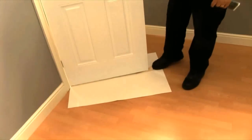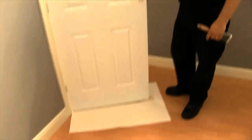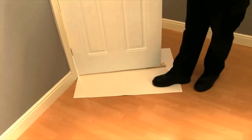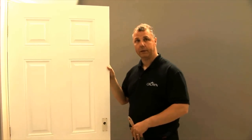As you can see here, I've also used a door wedge — just a little piece of timber there. It really gives me a nice solid frame to work with without having to touch it. The other thing that might be helpful is actually just a piece of cardboard, or in this case a piece of paper, sliding under the door. That will catch any of those flickers of paint that sometimes come off when you're painting the panel.